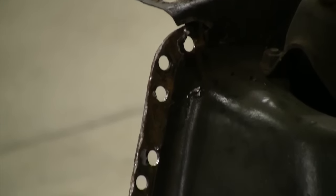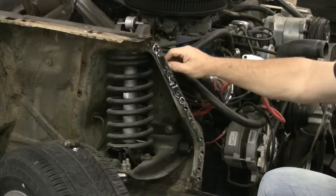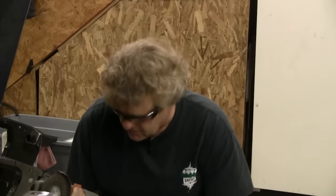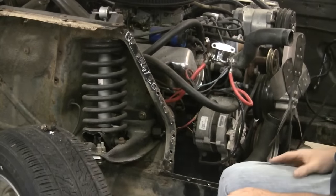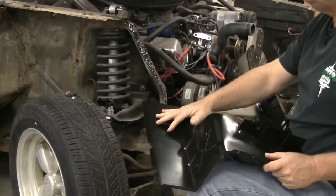Next up on this facing, I'm going to go in and grind because I've got some places where a little tab of metal came up whenever we were spinning the drill through there and it just peeled the sheet metal back. I'm going to run the grinder through here to clean all that up so the panel will sit nice and flat. You need to grind all of this stuff flat. Then I'm going to put the panel in — I want to keep as much of this E-coat on here as I possibly can, get the panel all fit and ready, then mark it up for position.